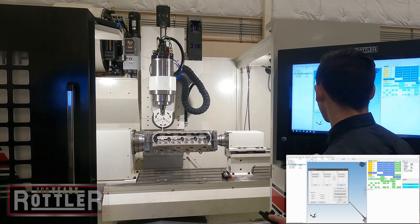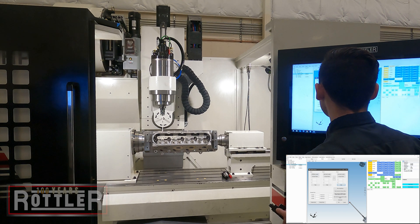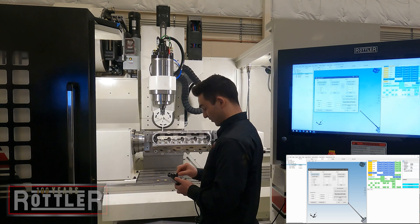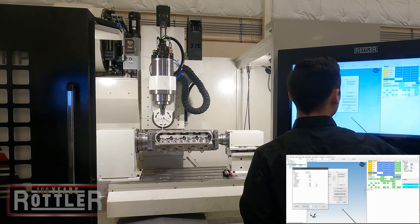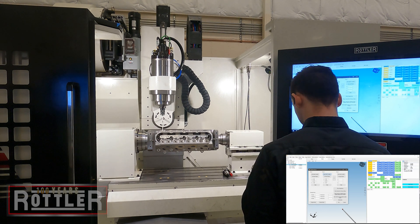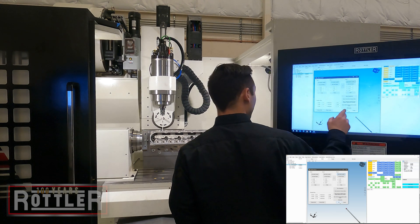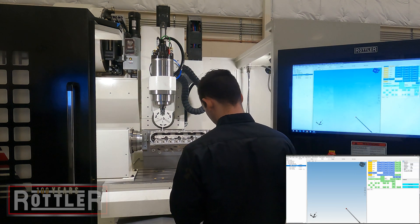While touching the locations, I can set point 1, 2, 3 using 'Set Current Location.' When I click that, it picks up the XYZ coordinates of where the probe is currently in the machine. I'll do this for all three points on the manifold side — probe auto center, let it touch, and capture points 2 and 3. Once I've got those three points filled out, I press OK and that creates my first plane — my manifold plane.